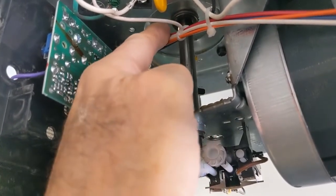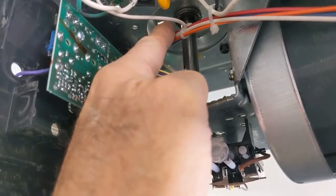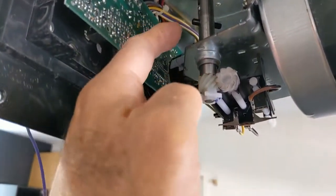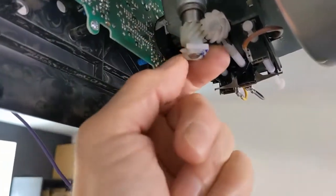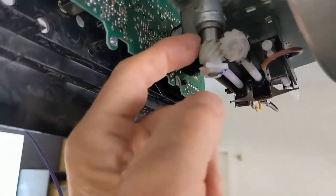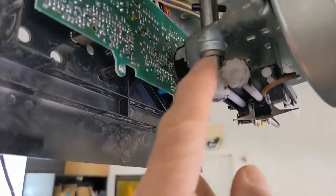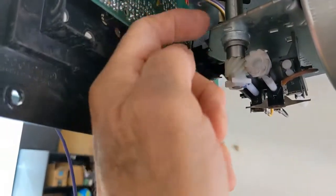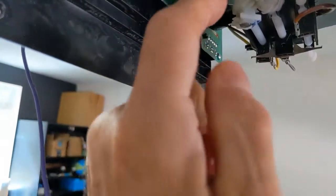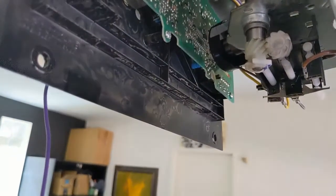There's another word for that — it's not a split washer, maybe. Put it down in the comments if you guys know what it is. And then take this little loose clip here — that's just a plastic clip — take that off. This would drop down and then you could raise that shaft up enough to slide the new gear on and put it back down. The new gear would engage with that spur gear — I think that's called a spur gear — over there. Put this back down, clip this back on, clip that washer back up there, and it should be done.